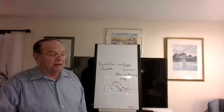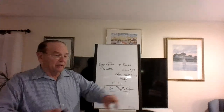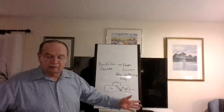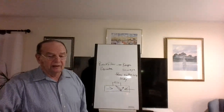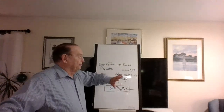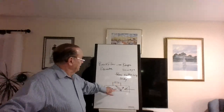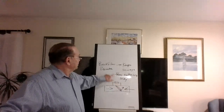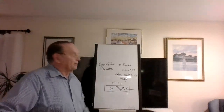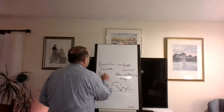And for those of you who haven't seen it, especially you tier 1 guys, just picture a tide mark, except it's sewage that dried. And you can imagine what a mess that is. Nothing you want to deal with. Okay, so if you ever bump into a house that has a cover missing, fix it. All right? And if the inspector tells you he wants a backflow preventer, it is a backflow preventer, but it's also called a backwater valve.